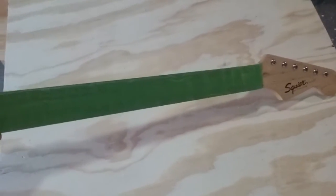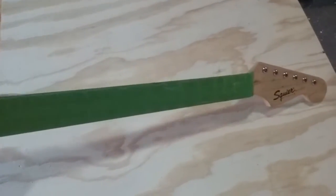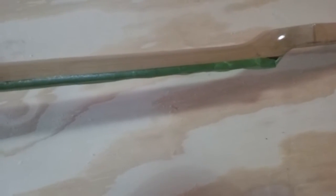And as for the neck, I personally, when I got my guitar, the neck had lost its shine, and it was awfully dirty, so dirty that I couldn't clean it with cleaner. So I had to sand my neck down. And what you want to do is, when you sand these down and polyurethane these, you need to tape off that fretboard. Tape it all off. Don't let any of it show. The edge is very important. Make sure you tape that edge off.